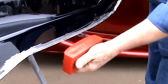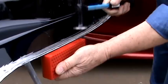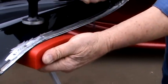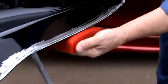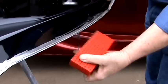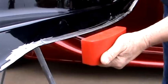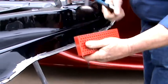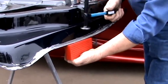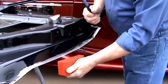There's a polyurethane dolly, when you're hitting it, see how the dolly stays there, so it's not damaging the other side. And you get in your small curvature area to work. The different anvil effect, bringing it back and forth, crimps it down. Your different anvil effect will crimp, like on a Honda door, it will crimp. If you need it on the Ford door, you turn it around, you get your different anvil effect.